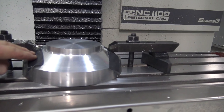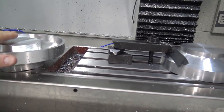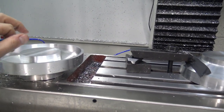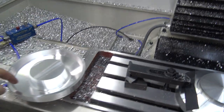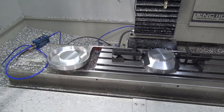But I like this idea because strapping down here pushes the center boss down against something, which I think is going to help with rigidity. The best thing, I think, and in fact what I'll do if this doesn't work, is we'll machine a plate that has a boss in it, and that'll give me the locating diameters, if you will.